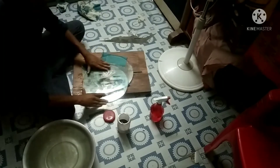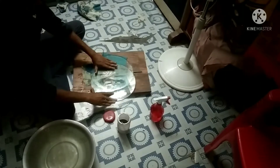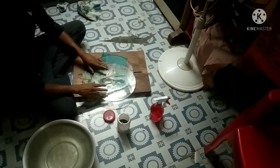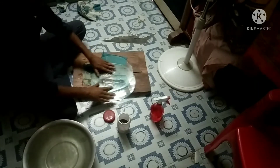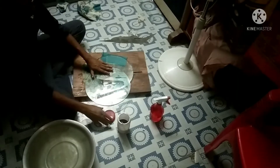This is called chordal stroke. My mirror is very thin — only 8mm — so I am not going to put too much pressure on it. Always maintain 40% overhang while grinding.